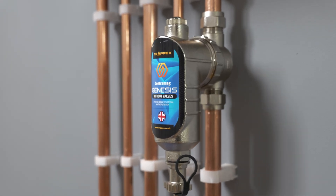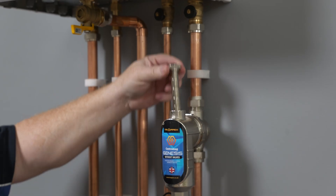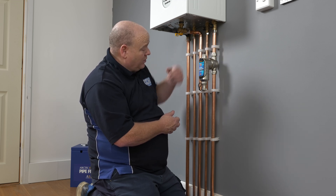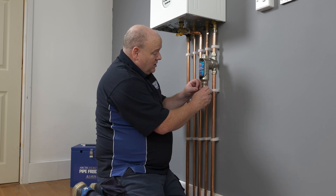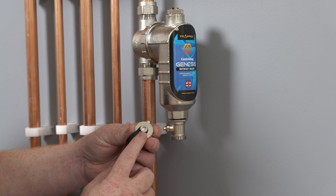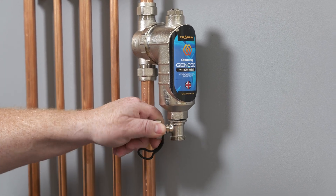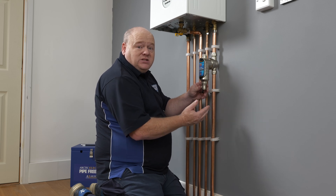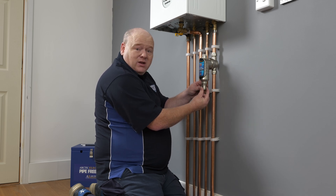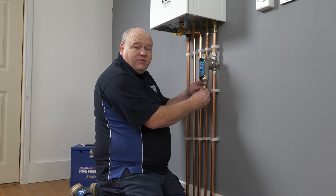What do we think of this filter? It's a brass-bodied filter so you're not going to have any issues with leaking. It's got a strong magnet, and we've got enough clearance underneath the boiler to get the magnet out when you come to do a service. It's got a really good connection on the bottom that connects into the valve to open and close it. A little tip: if you've got a washing machine hose, you can connect that onto the bottom — so when you do a service, have a little bucket and washing machine hose and you can just flush the filter out.